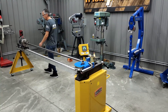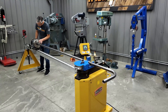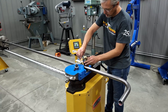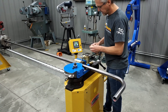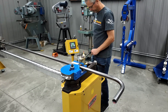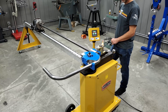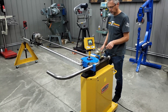Now that we have the first bend completed, we can pivot this around, slide the tube into the next stop, bring it back to our hard stop — we'll leave it right on zero — and lock the tube back into the die set. We're ready for our next bend. You may want to use some bending lube occasionally, so we can put a little bit of lube on here as it draws into the tube to help keep the sliding part of the dies lubricated. Back into our reference mark at 355, ready to do bend number two. Bend number two is complete — reverse it back.